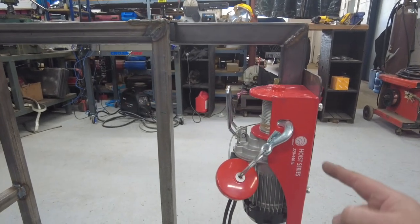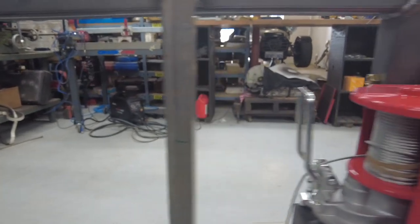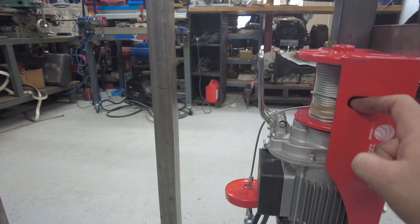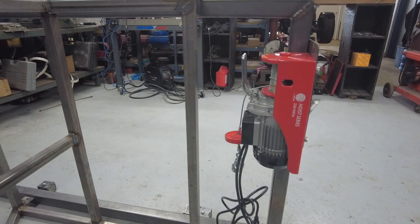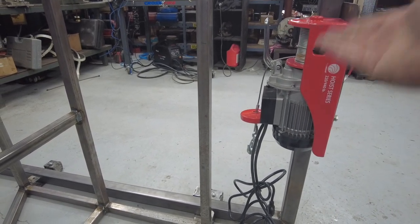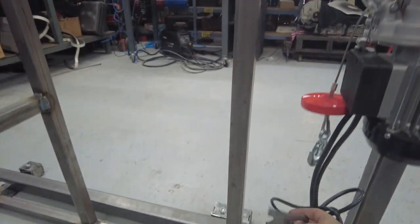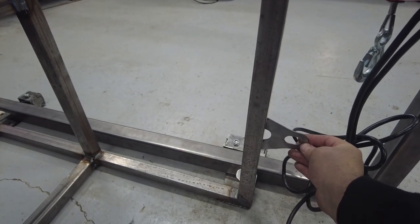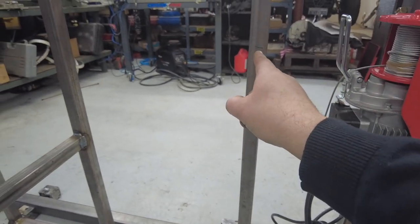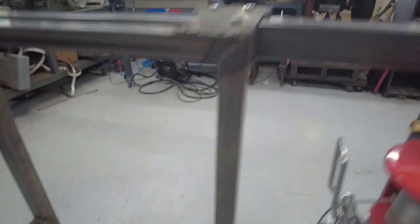I've got the winch mounted, and we're not going to run the cable straight like that — it has to go through a snatch block in order to multiply the force. So it would theoretically come down, loop back up, and come up over to here, because I had to mount the winch off to the side. Once it's up against the pole, the mounting couldn't be in the center because I need the pole as support. So I'm going to weld on a bracket here, a corresponding bracket over there, and another bracket up top — the steel cable goes here, down through two snatch blocks, and up over there, so it should pull evenly. That's the goal.